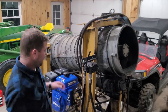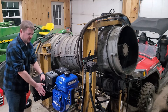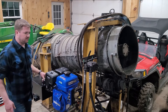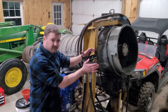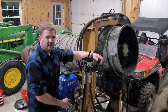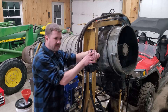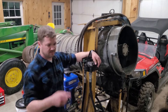All right guys, pretty excited. We finished our hydraulic starting unit for this jet engine. We've got a hydraulic tank with five gallons of hydraulic fluid, our motor mounted up, oil in the motor, gas in the engine, hydraulic fluid everywhere. All the fittings double-checked — everything should be tight. We mounted our valve to roll the engine over. This thing is an open center system, so it should circulate fluid. When we fire it up and it looks like it does that, then if I give it some valve, it should redirect fluid into the gearbox and the auxiliary power unit to start the jet engine and start rolling it over.